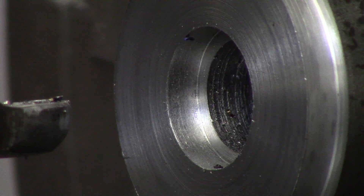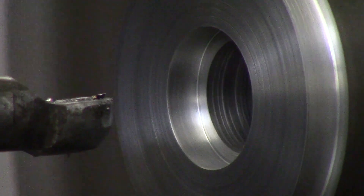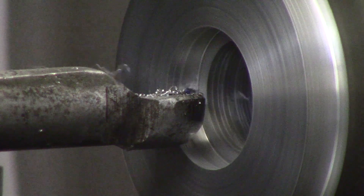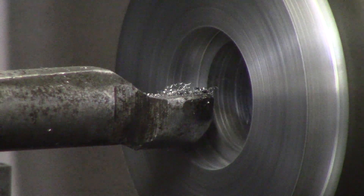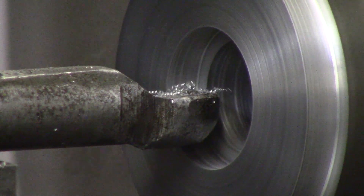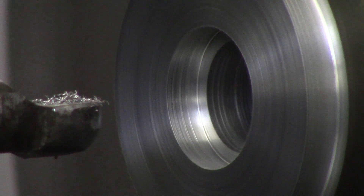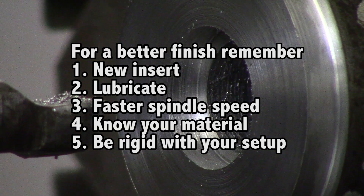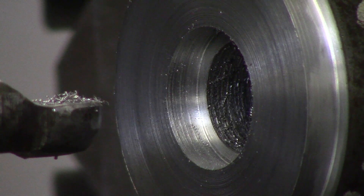Not only will boring have push-off, but the hole will also be tapered. I went back to zero, turned the spindle back on, took a light spring pass without moving in at all, and it still cut material. The finish from that spring pass isn't as good as the previous one. Sometimes, depending on your tolerances — plus or minus five to ten thou — you can take one heavier cut for a good finish, but that cut may end up tapered and a few thou under size.